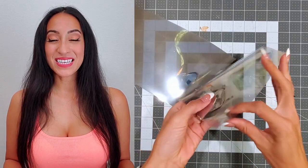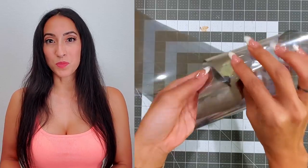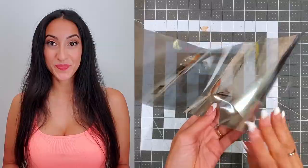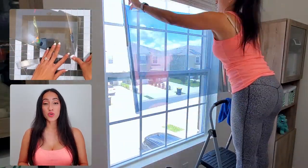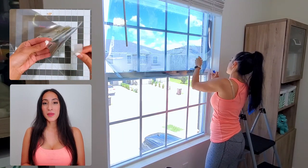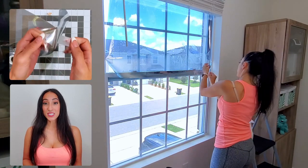The window film has a protective layer to keep the adhesive clean. Gently rub the two sides together, but be careful not to crease the film. You're going to feel that one side is more slippery than the other — the slippery side is your protective film. To pull it off, put two pieces of scotch tape facing each other at the corners and peel apart slowly. As you pull apart the window film, you're going to want to spray your application solution generously. This reduces the static charge that may attract dirt or dust onto the film.